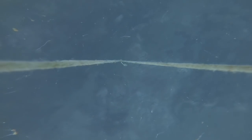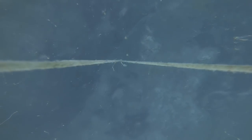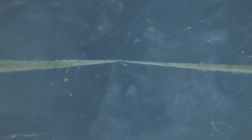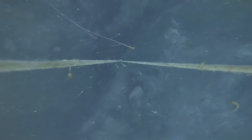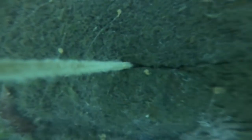I see that none of the chain is visible, and it indicates that the chain is well buried. The camera tether is attached about 5 feet away from the anchor. And we'll see here shortly that we get a case of the camera plunging downward into the seabed. That is a result of seabed sort of capturing the tether. It's another indication that the anchor is becoming extremely well buried. And it just shows how soft this substrate is for an 1/8-inch cord to just sort of cut the seabed like that. It tells me that at least the upper layers of the seabed are very, very soft. We can hear from the motion that the camera is moving through the substrate slowly.